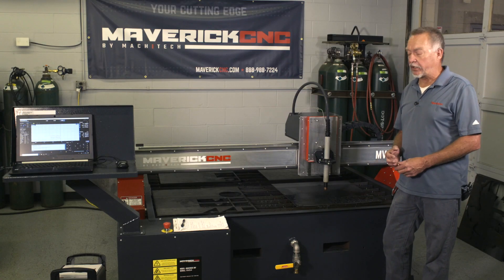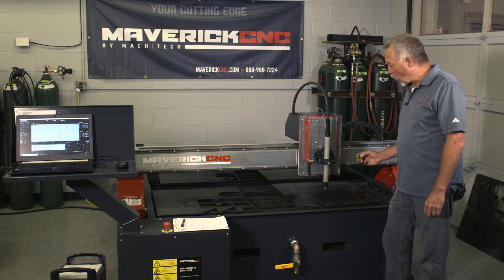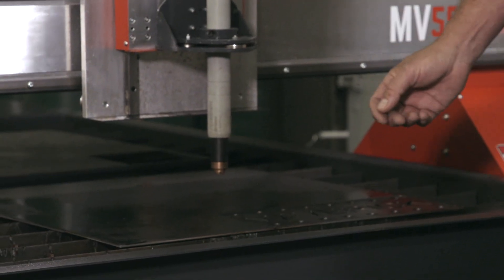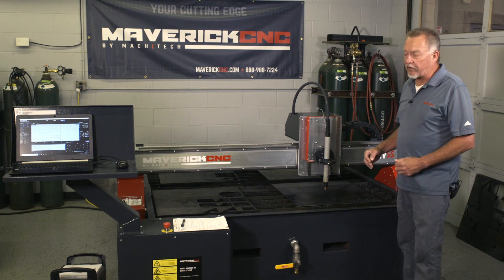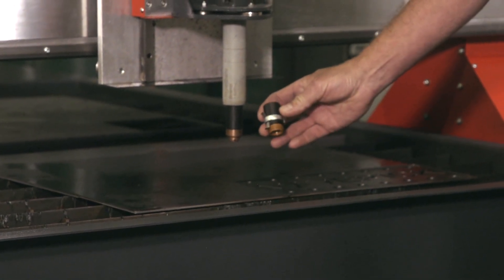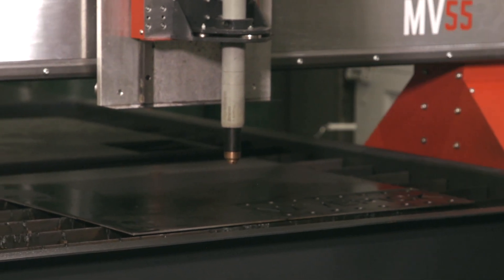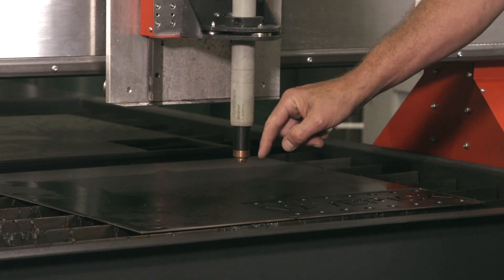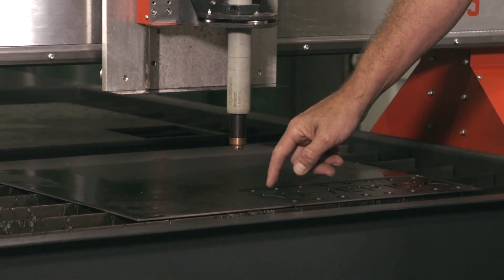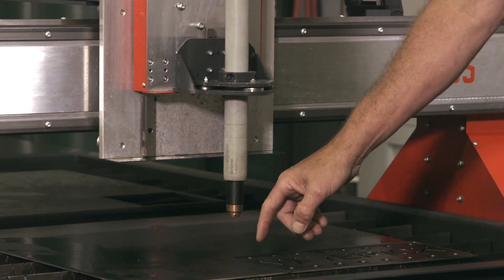That's what gives you superior cut quality and excellent consumable life. Another important feature of the torch height control is something called ohmic contact, and that's the way that the surface is sensed on the plate. If you've got a CNC machine that does have torch height control but uses the Hypertherm retaining cap like this, as opposed to this retaining cap — this retaining cap has a connection for a wire that's called the ohmic connection wire. Every torch height control system has to have a method of finding the surface of the plate. If you don't have that wire on the front of the system, you're going to be using either torque sensing or what's called floating head sensing — a micro switch in the torch head that allows the torch to locate the surface of the plate.